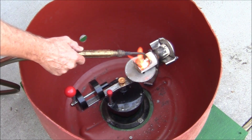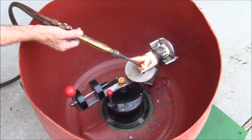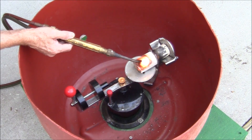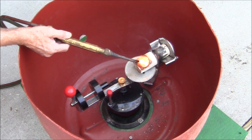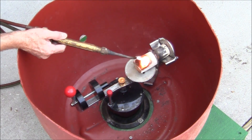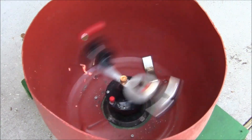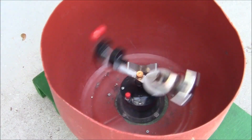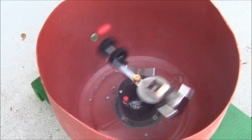The wax just disappears — it's heated so highly it's meant to disappear like that. I've brought the flask and put it into the centrifugal casting machine with the silver pieces in the crucible. I've wound up the machine three times and have it held, ready to release as soon as the metal reaches the right temperature. Silver melts quickly with this very hot oxygen-acetylene torch.